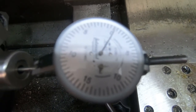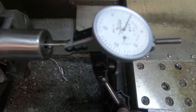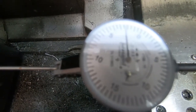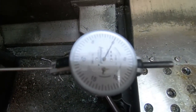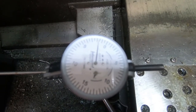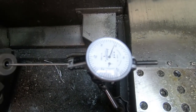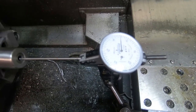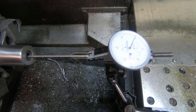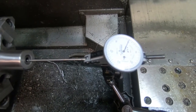We want to make sure it's the best it can be. We'll wind this out to where the crown area would be and take another reading. At that point it's reading almost perfect - maybe one or two tenths of a thousandth. We'll see if we can get that last little bit to read perfectly zero, and then we'll run the program. We need to make sure there are no baffle strikes - if the customer is going to use a suppressor or put a muzzle brake on there, we don't want the bullet contacting anything as it passes through. We want it as perfect as possible to ensure accuracy and provide the best performance for the rifle.